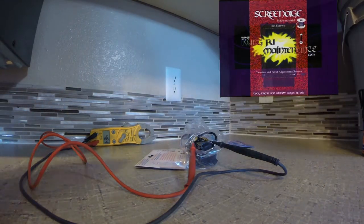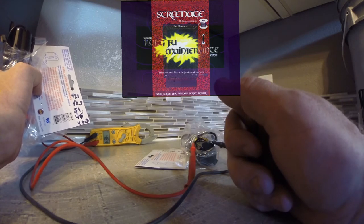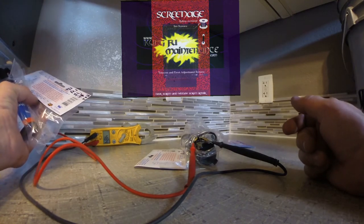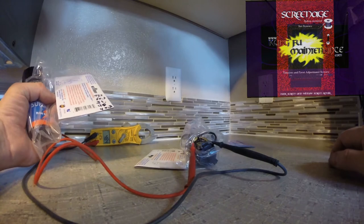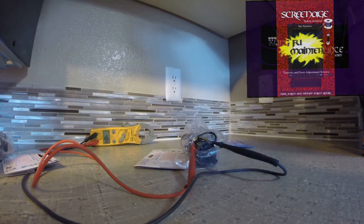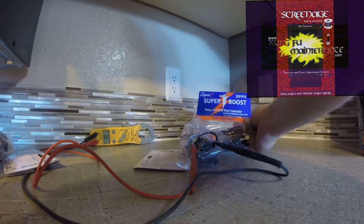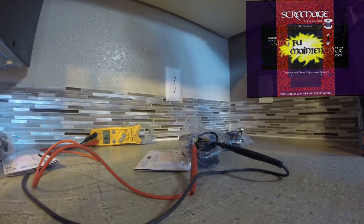So what we conclude is these are right around 50 — ranging from 45 to 51, with one jumping up to 48.4. Very interesting. It's only in the circuit for 0.5 seconds — that split second has an initial draw to change the angle. It's kind of like if you're going to start a fan motor, you'd want to move the blade to make it spin, get it started. It's this super boost that gives an initial 300% extra torque on the compressor. This is the SPP5.